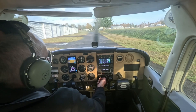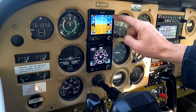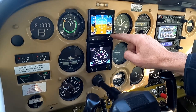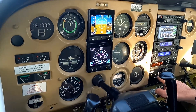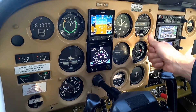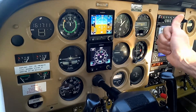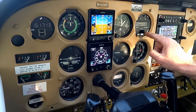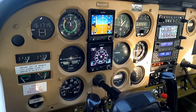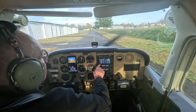Now in G5 mode, it's taking a look at the altimeter setting from the G5. If I have it at GPS, I have to set that altitude and select it. Right now, that agrees with the altimeter setting that I was given. I agree with it, so I need to accept it by pushing the encoder one time. Now I have that. There is no flight plan, because I don't have a flight plan.